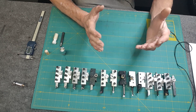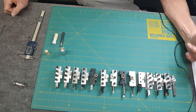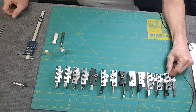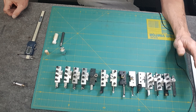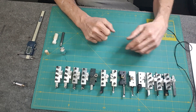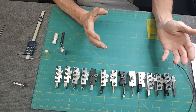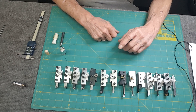I'm theorizing about a large lathe since the last time I ran one was in eighth grade making a screwdriver for shop class. My thoughts on a large lathe are just theories. When you're turning, more length gives less likelihood to bend, tweak, or move. More mass changes the harmonics of the entire lathe, keeping chatter down and so on.